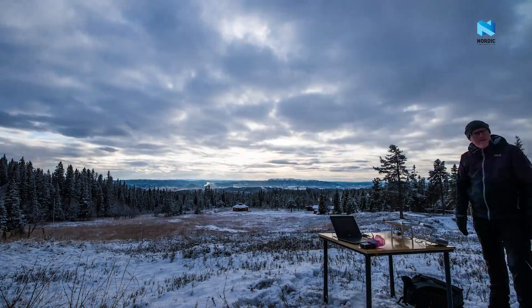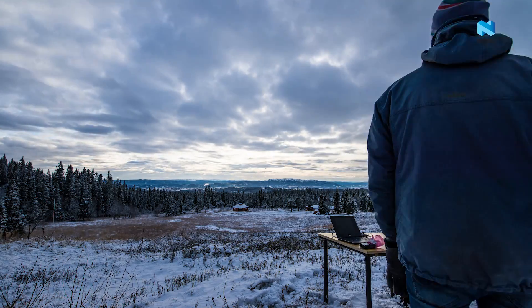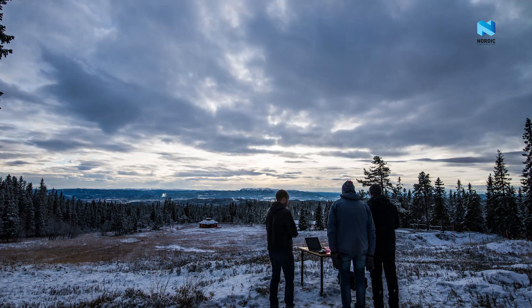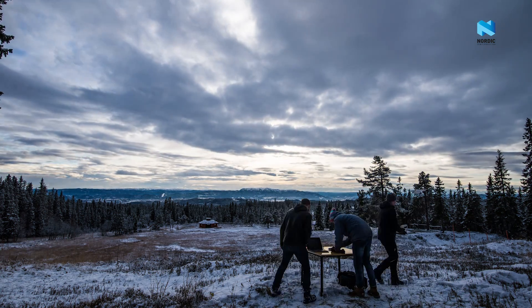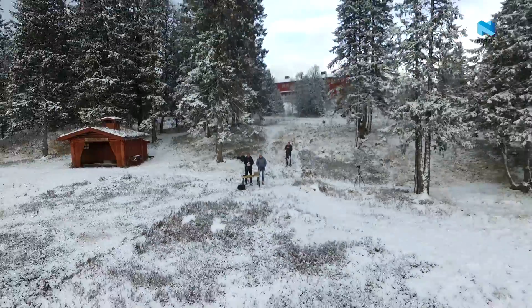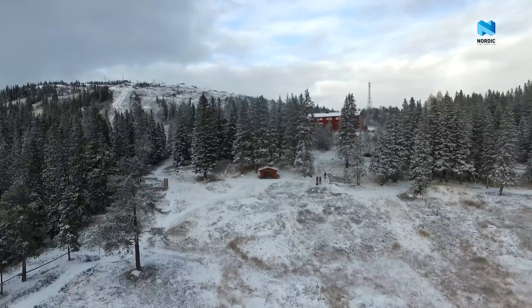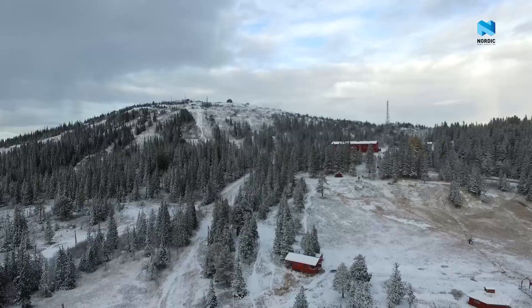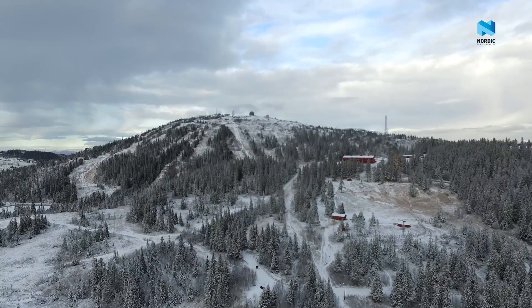The results of the tests were promising and we were able to reach the limits of the drone range with some signal to spare. With more than 12 dB of margin between the incoming signal and the sensitivity limit of the receiver, communication should be possible at ranges four times as high as those achieved in this test. In an urban environment we would naturally expect a shorter range because of obstacles and interference, but we should still see a significant improvement over existing solutions. Please stay tuned for more videos from Nordic, and thank you for watching.